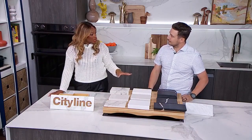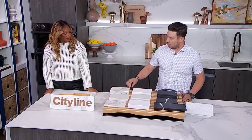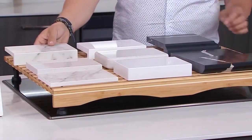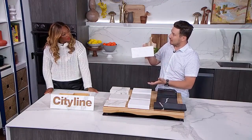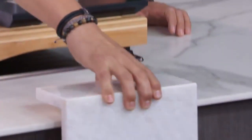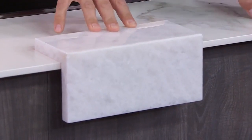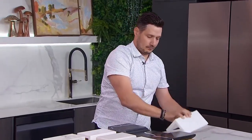In terms of cost, this goes from least to most expensive. The mitered edge does add quite a bit of money as there is quite a bit of work involved — cutting those edges, polishing them, having it all line up. With mitered edges you can even drop down further to make something look very chunky; put it on the edge of your countertop and it now looks like a six-inch slab as a vanity instead of just your inch-and-a-half or half-inch profile, even though it's hollow underneath. A big shout out to Latitude for the beautiful work with our City Line countertops.